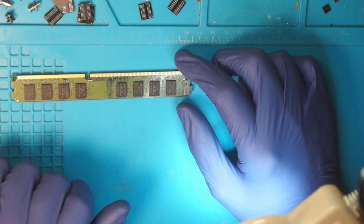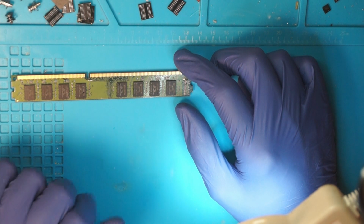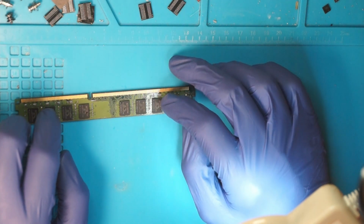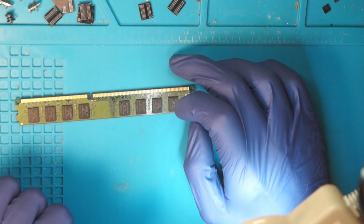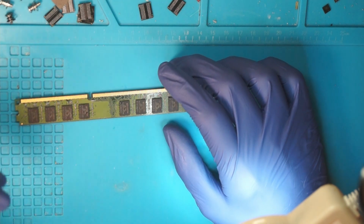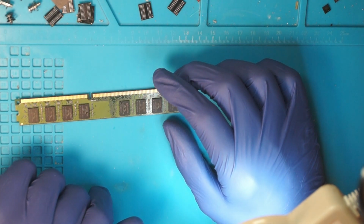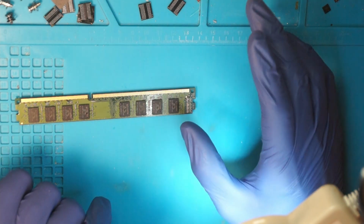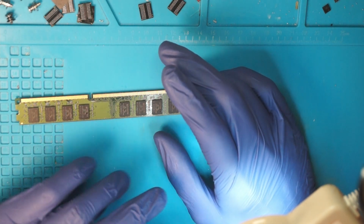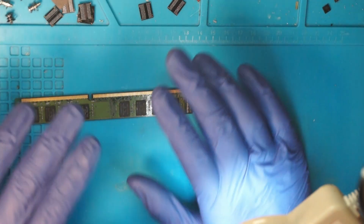What I used is an old MacBook Pro motherboard that's dead, but it has 16 GB of soldered on memory, so I can make 2 8 GB sticks from that. Now if you go with old motherboards, you have to be a bit careful, since DDR3L, which is what I'm going to use, is compatible and will work, but not LPDDR3. LPDDR3 is used in MacBook Airs, and that's a completely different technology. It works differently, with different voltages and everything, and will not be compatible.